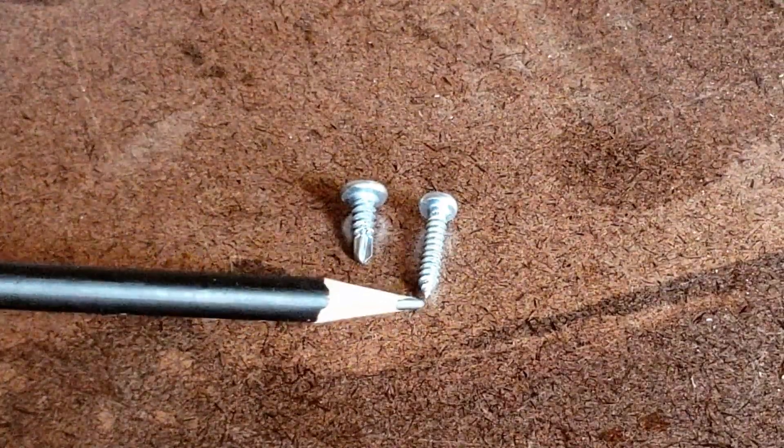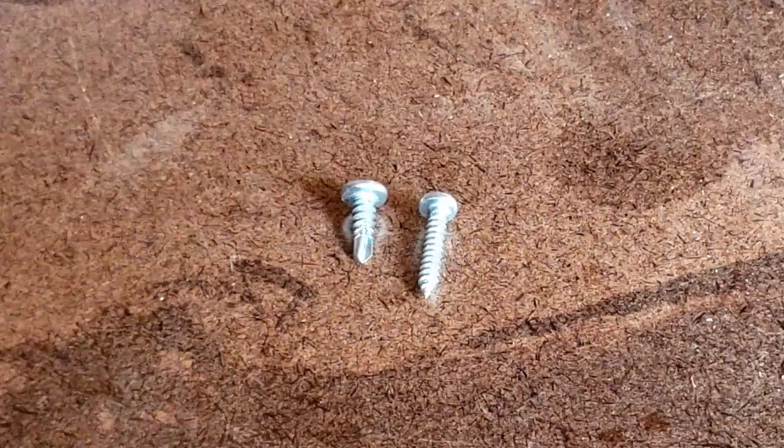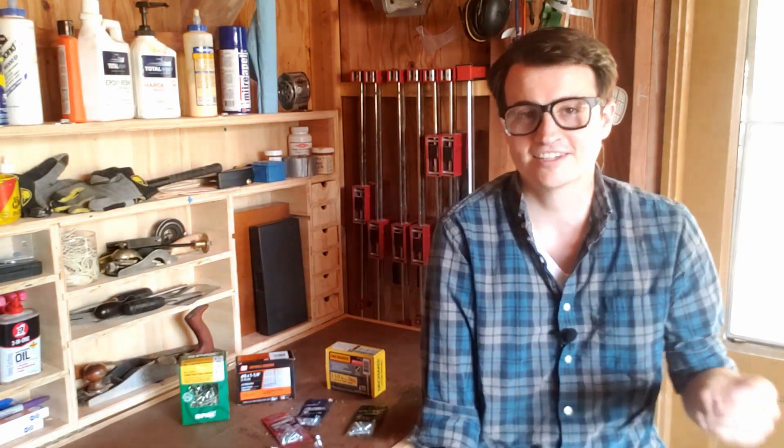Sheet metal screws can be used to attach two pieces of metal to each other or to attach thin metal to either wood or plastic. Sheet metal screws have a pointed tip or can have a self-tapping tip, which allows them to cut a hole in the metal and whatever is beneath. A self-tapping tip tears a hole the exact same diameter as the shaft, slightly different from a self-drilling tip which tears a hole that is then spread apart by a tapered shaft. I prefer to just pre-drill my holes because the self-tapping screws can slide around on the metal, making it a struggle to get the screws where I want them.